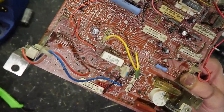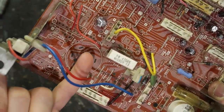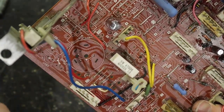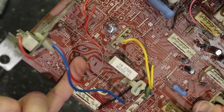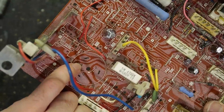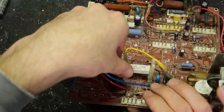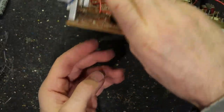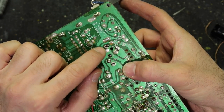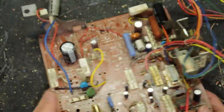Alright, I figured it out — zooming in you can see these white check marks are exactly the same as the copper traces on the back. You have two islands here to stabilize the capacitor because it's so big. You have the positive and the negative — it can't reach these two holes which is where it was before, but if I bend one on the positive into that little hole and the negative right there — instead of here it's going to go in there, and instead of here it's going to go in there. It's just barely making it. Feels pretty good — that one's in.